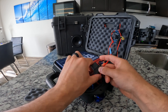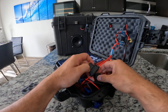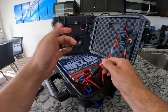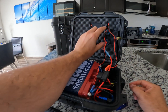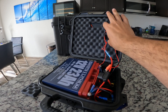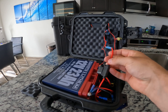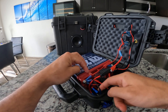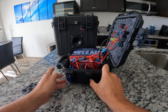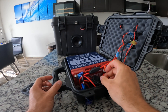This is a really good battery — it has its own BMS system. I also built a lot of redundancy into this for safety. I have three different fuses in here. You might not need three, but I like fuses everywhere just in case a wire gets really hot — the fuse pops before anything starts a fire. I drilled two ports out using a step-down bit; the outlets came pre-wired so I didn't wire those myself. I put them in on a quick disconnect with a fuse going from power to the switch, another fuse from the load to the outlet, and I added an SAE charger on its own fuse using eight or ten gauge wire.